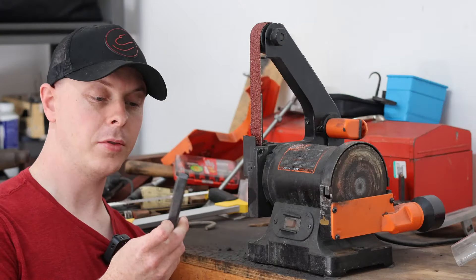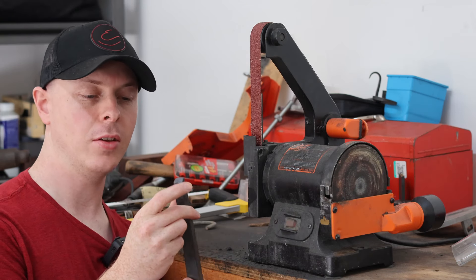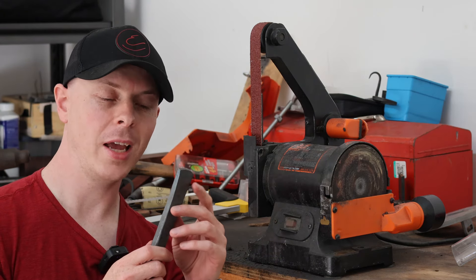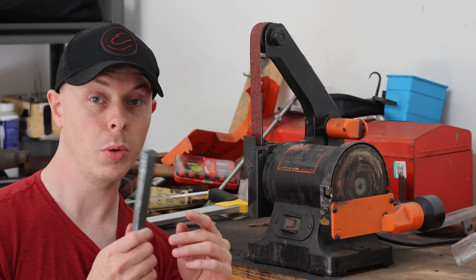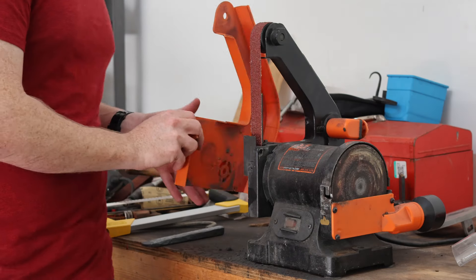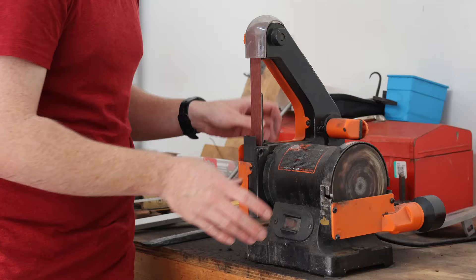This thing is cooled down. The first thing I'm going to do is grind off kind of the ends — I'm going to take this to a bit of a crown or a rounded end there on the struck end. Then we'll go ahead and switch to the business end and grind everything to final shape, and I'll explain that as I go. I've got a 40 grit belt here, and I got to make sure I put the covers back on for safety.